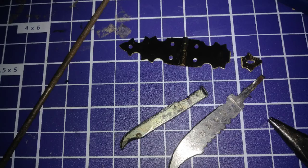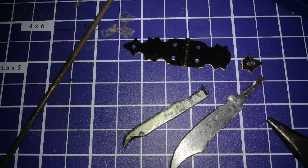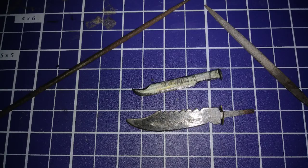After removing the plastic handles, I cut a piece off this decorative brass hinge for the handguard. I didn't want the handguard to be very big, so I cut the very tip of this brass hinge off and widened it with a file. After I got it wide enough, it slipped right onto the tang.